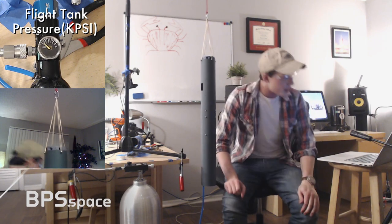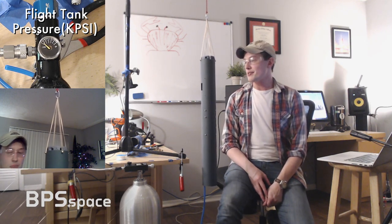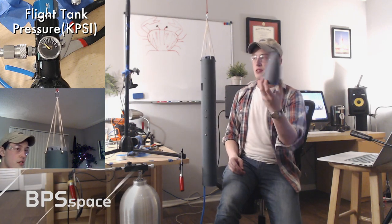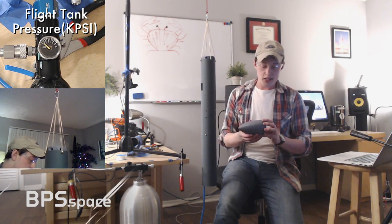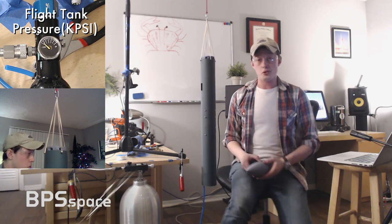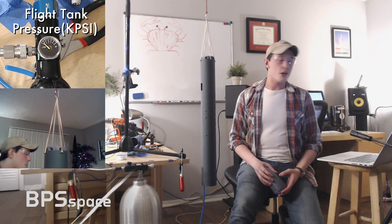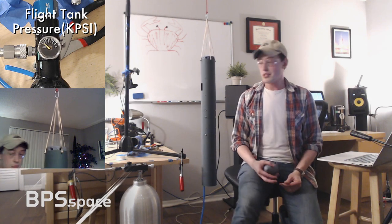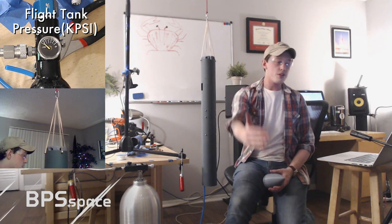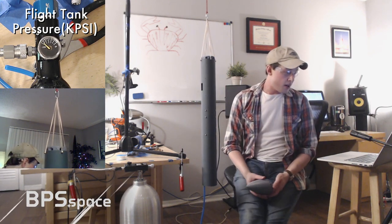Disappointing to some. Don't leave, the stream isn't over, but we only had a couple of tests that we got to do today, and we saw that the effectiveness of these very close together roll thrusters is just not that good. So in the next design revision, I will move these roll thrusters further out, so we have more control authority over the vehicle, and that way we don't have to double up on valves and double up on what is essentially failure points. Because if one of those valves fails, the vehicle does not roll, it just goes in a sort of weird diagonal direction, and that's not good.